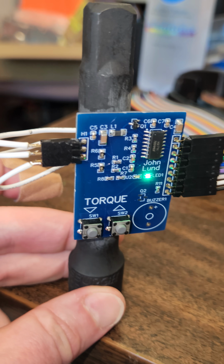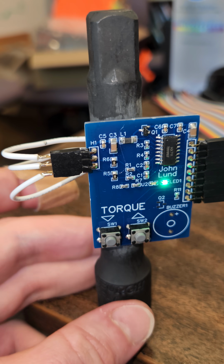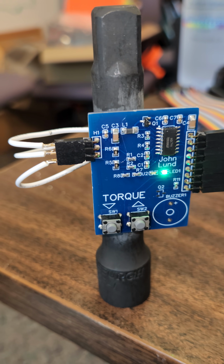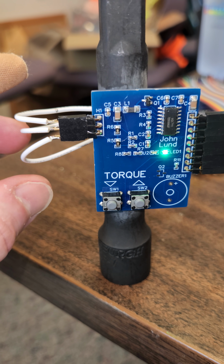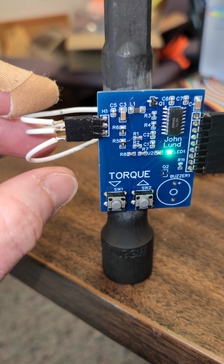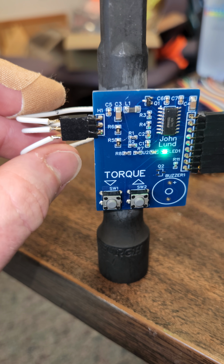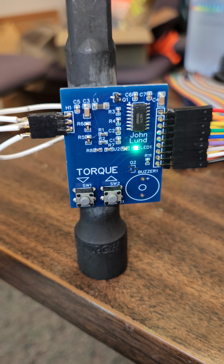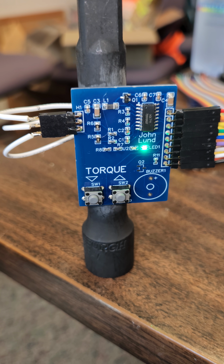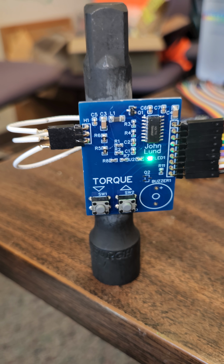So while you're using this, you really want to make sure those wires are either really flimsy going to the strain gauge, or that they can't be bumped or squished, because just the strain from the wire can trigger the strain gauge, as you can see. So anyway, some thoughts to keep in mind. I just want to show you my example.